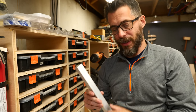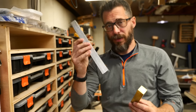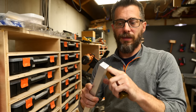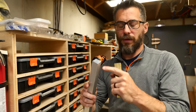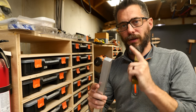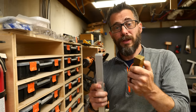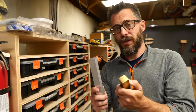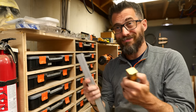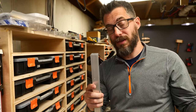I'm going to use aluminum and brass for this and I've got these kind of blocks. I'm not going to need very much material, so I have plenty of opportunity to screw up and still have a lot of material left. By starting with something like this I can just worry about taking off what I need in a very small area with a material that's not very hard. Aluminum and brass are both softer metals — non-ferrous — and they will cut differently than steel, but they should be easier for the machines to go through, which means theoretically there shouldn't be as much danger. Really the point is I want to start on something softer and easier to work with, and then I'll work my way up to steel later on.